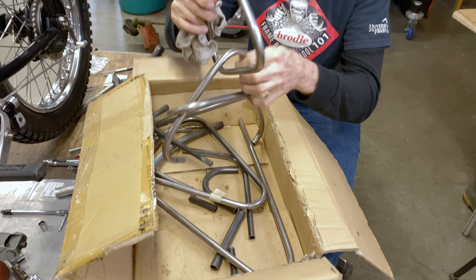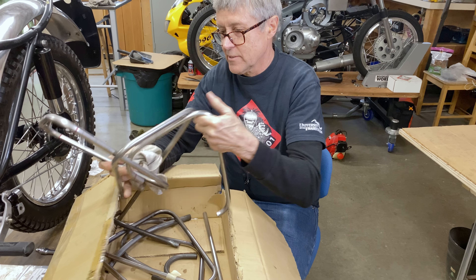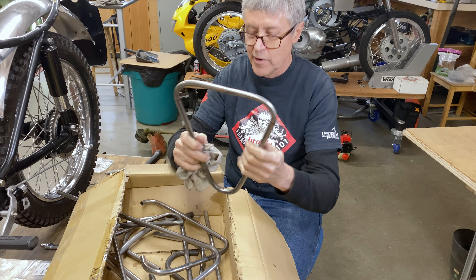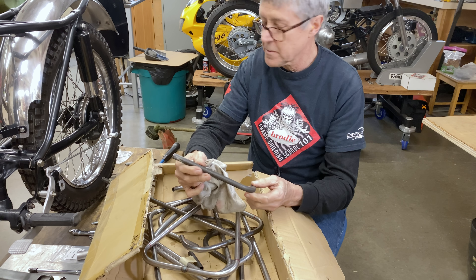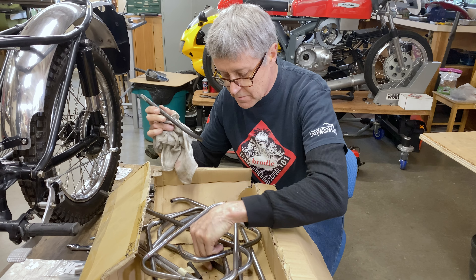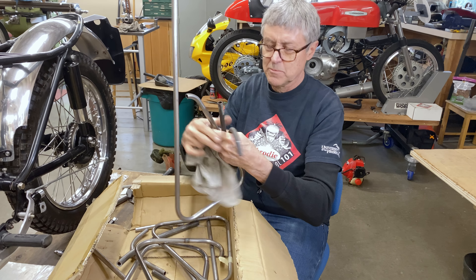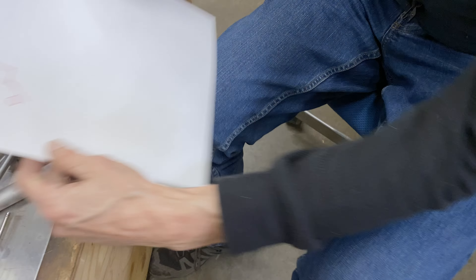Here's what we have. I found a large washer — there's the piece that just got made on the lathe. It's about three quarters of an inch long, so if I get a half inch tube I've got room for a little TIG weld on both sides. I like the looks of it so far — it doesn't look out of place. I'm going to go in the back now and look around to see if I've got any half inch tubing that has a little bit of a bend in it, and once I find that I have to come up with some kind of a cap or a shape. Anyway, one step at a time.